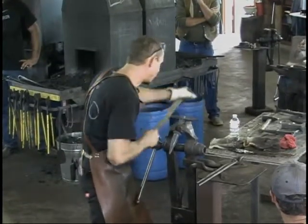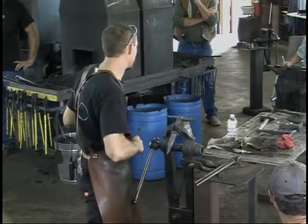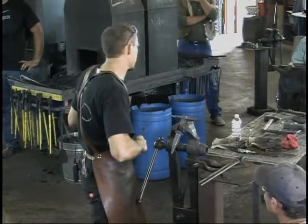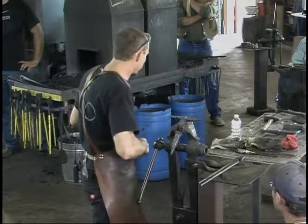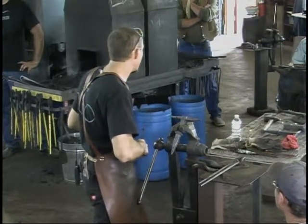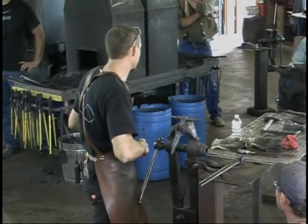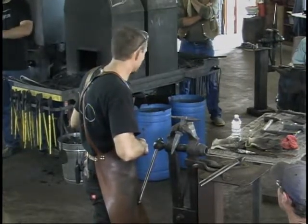Yes, you might as well. Yeah, a real rough, a very coarse grit, very aggressive. So if you want to use a ceramic aluminum oxide or zirconia, that's cool. If you want to just use a regular aluminum oxide, but a very coarse grit, brand new. Brand new. Yeah, if it's been on there for a month and it's worn down, it still looks rough, but it's worn down, you're going to waste your time. The thing's going to get hot. You're getting nowhere.